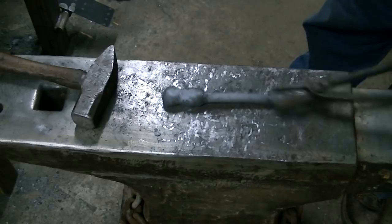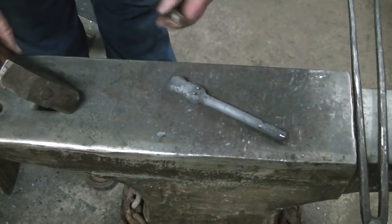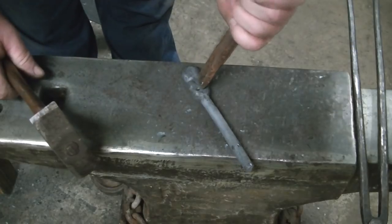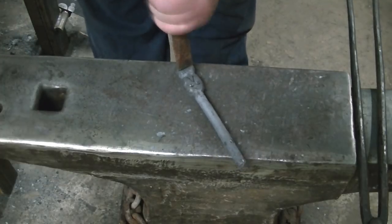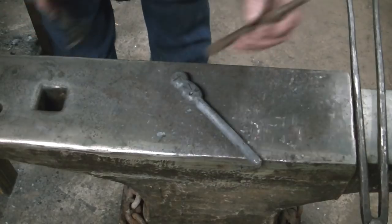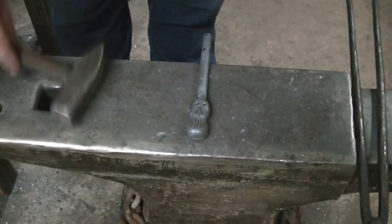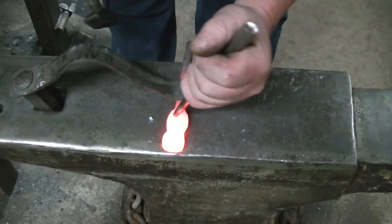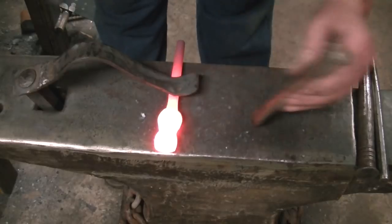So we get our punch — this is the one I made out of A2 steel. I was told it was going to break right away because I didn't anneal it properly, and here it is months later and it's still working just fine. We're just laying out these lines at the moment. We're going to have to make these features in the skull pretty aggressive, because once it transfers into the die, a little bit of that definition is going to be lost, and once you press-forge a piece into that die it's going to lose a little bit more. So when you're doing this you have to make somewhat extreme features to be transferred.